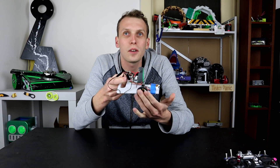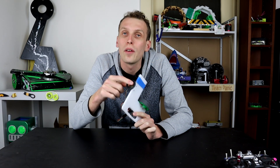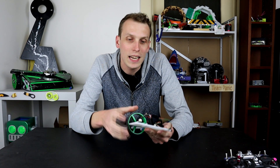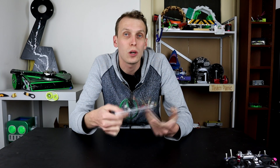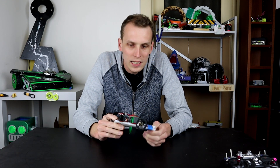This steering wheel out the front was a little bit of a weird thought I'd put together from seeing a few bits and pieces online, and I thought maybe that would work. I was also considering changing it out for an Omni wheel or a Mecanum wheel in the future. However, as you saw in the testing footage, this did not work very well — the DF Robot ESC on the back seemed to be browning out.